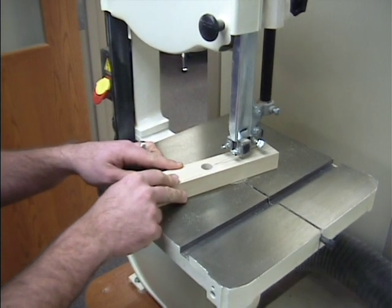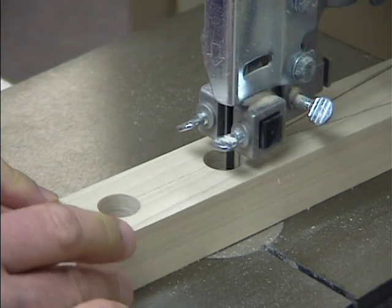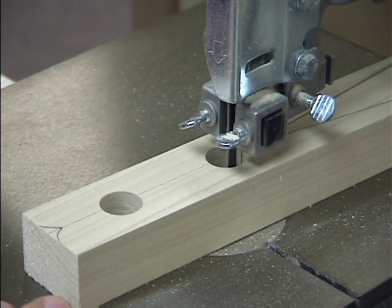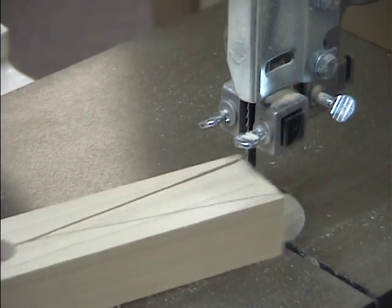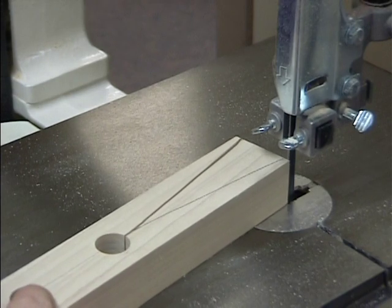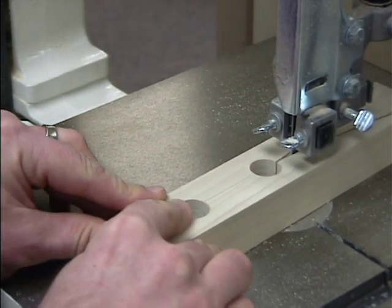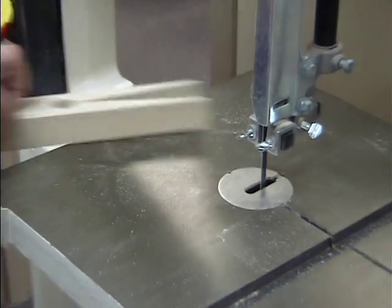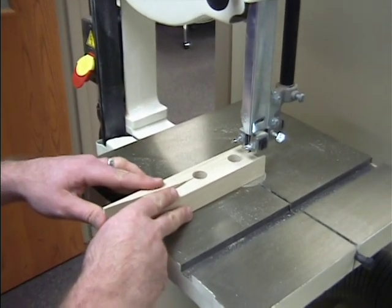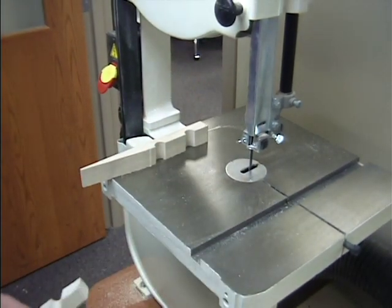Your instructor may choose a second method for cutting your super clip. The first cut would be the same. The difference is when you get to the inside hole, you will turn off your band saw and wait for it to stop. Once stopped, back your blade out and make a second cut much like the first — except you do not turn the super clip block around. You just make two very similar cuts, which is sometimes found to be easier. Then you make the center cut the same way, going straight down the middle.